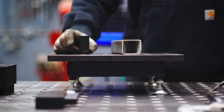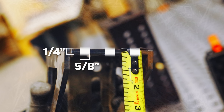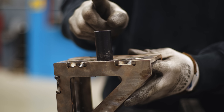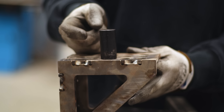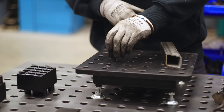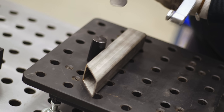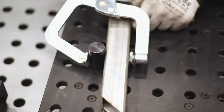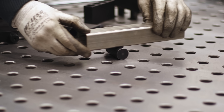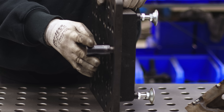Because this plate steel is five-eighths this isn't so bad, but when you start going to the thinner tables — like this quarter-inch less expensive table — this really starts getting pronounced. This is supposed to be a stop but there's just a lot of wiggle room in here. It also doesn't help with clamping; when you put the pin in the hole and want to put material up next to it, the clamp doesn't want to stay on the pin. It's really hard to use as a shim because it likes to roll around on your work material. And if you try to go into a surface it wants to wiggle its way out and fall out of the hole.